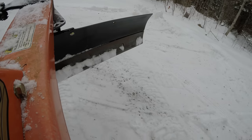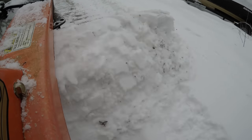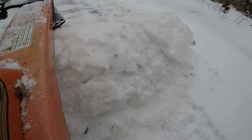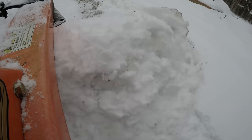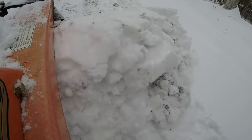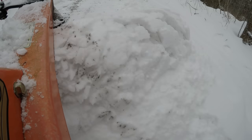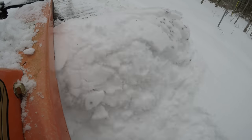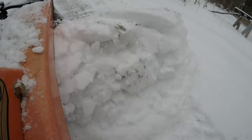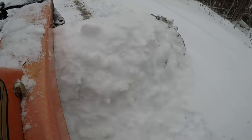Today's going to be a clean-up day. What I want to do is drop the blade and scrape this out. Since I haven't had a chance to widen that driveway out, I've just been taking the blower down. I want to take the blade up and down the driveway and try to widen it right out to the shoulders — I usually do that with the blade. The challenge is that the way this winter's been going, I still don't know if this driveway's frozen. But there's one surefire way to find out — I'm just going to drop the rear blade and start dragging. If this driveway's not frozen, I'll start seeing gravel coming up. Then I'll know to use the blower.